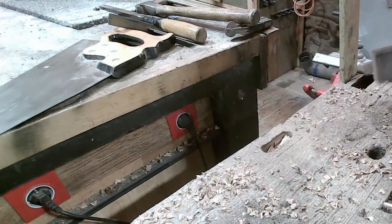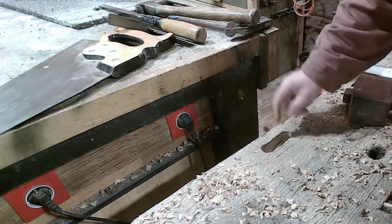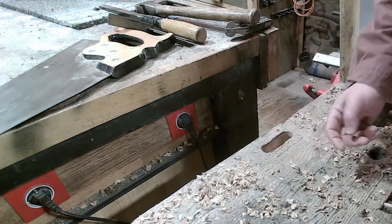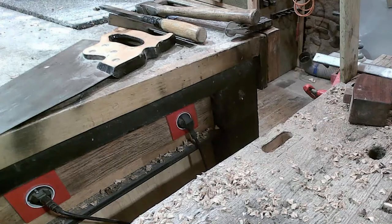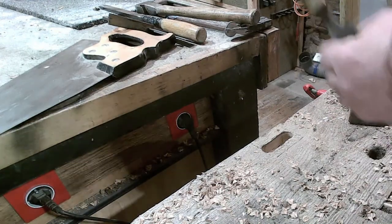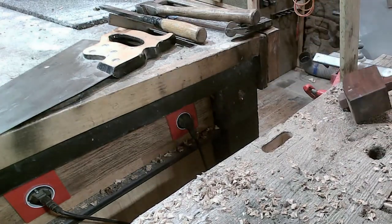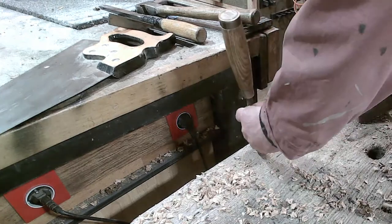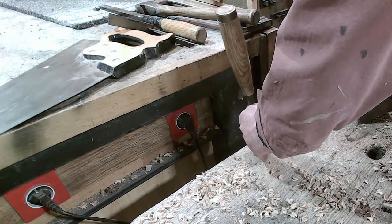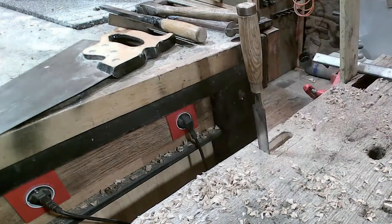It's like when you're boat building. I used to work with my dad a lot, because my dad was a boat builder. Whether it be fiberglass hulls with fiberglass superstructures, or a wooden hull. The wooden hulls are different. With a wooden hull, you've got the hog, which is basically near the keel. If that's not flat, if you don't start with that exactly where you want it to be, it makes it very difficult to get everything else right.